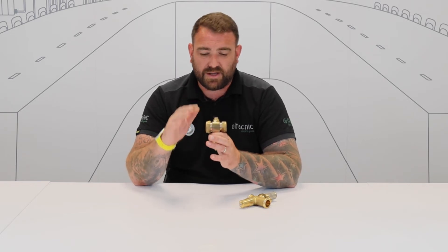These can be installed on the flow and return pipes into the heat pump system. The way they work is that if the heat pump was to fail and it's really cold outside — you've got freezing conditions — if the internal water temperature starts to drop to three degrees then this valve will start to open. What that process does is it allows the system to pull warmer water from inside the property or from warmer parts of the system to prevent that freezing, protecting the heat pump, potentially the plate heat exchanger, and all the other products that sit within the heat pump system that could get damaged if they start to freeze.